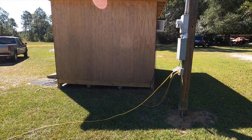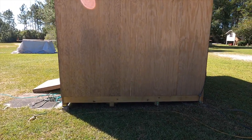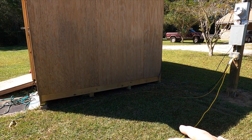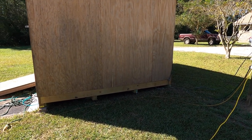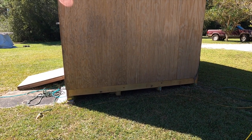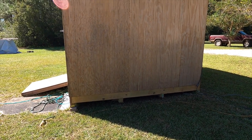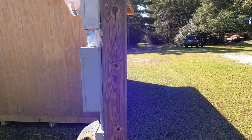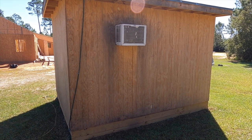It's basically sitting up on scrap blocks and wood. I leveled it up with 2x6 treated floor structure on 16-inch centers, and four 4x4s that are 12 foot long. On top of that is three-quarter plywood — just regular plywood, not treated, since it's off the ground. I used three-eighths T1-11 siding to side it, and the only opening for security reasons is where the air conditioner goes.